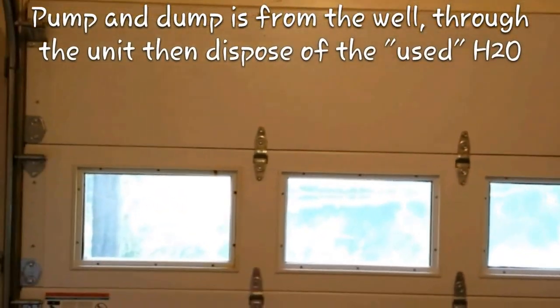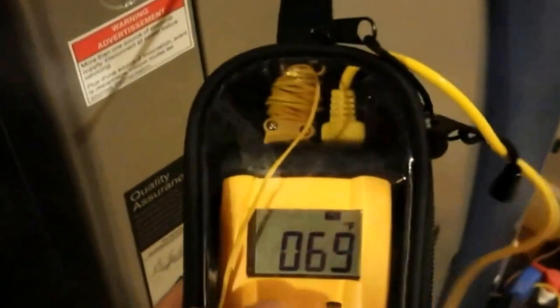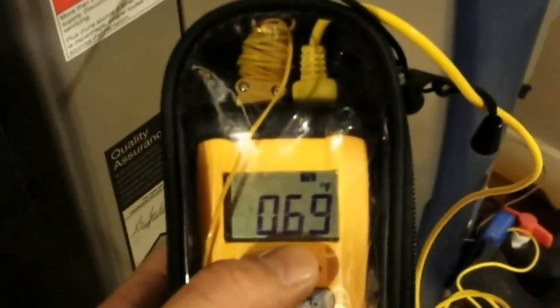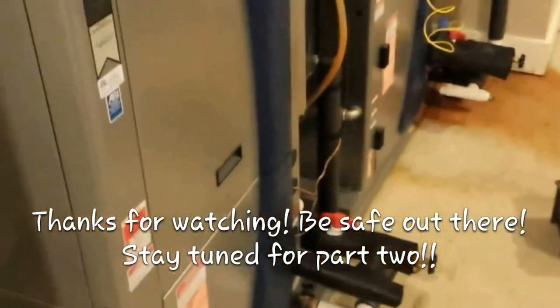Now, this is what we call a pump and dump — meaning he's pumping straight out of his well and dumping it into a pond out back. Open loop, pump and dump — there are a few different terms for it. Rather than a ground loop where you have all the tubes buried in the ground with a glycol-filled system. This thing over here is doing amazing — I have 54-degree entering water, 15-degree temperature rise on my water. That's great, that thing is pounding it out. I think the air temperature was 48 degrees coming out. On to the next one — see you soon.